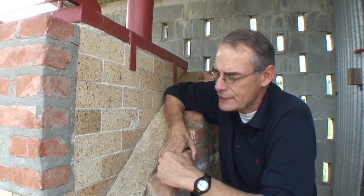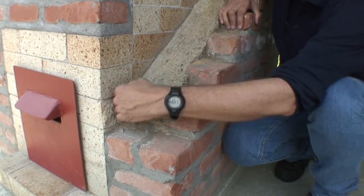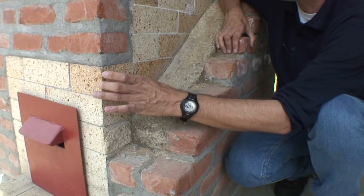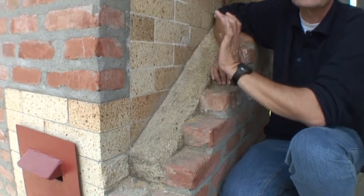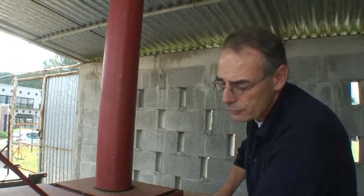We solve this by turning the brick with the rough side outwards — no refractory cement is needed there. The other side is very smooth, and since the width is about half of the length, it fits nicely. Regarding refractory cement: this is heat-resisting cement. Some people try to make it themselves with normal cement and additives, but I would advise against that, as it is most of the time not very heat-resistant. There are very good blends already available on the market — just add clean, non-salty water, mix it, and you have a perfect refractory cement. It contains mainly aluminum oxide, Al2O3.